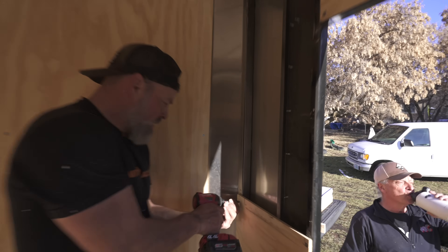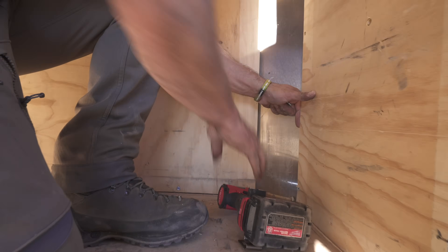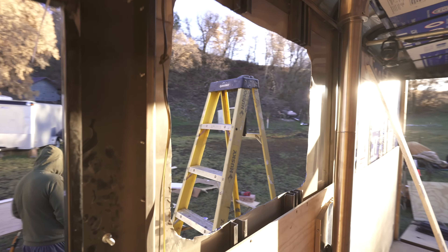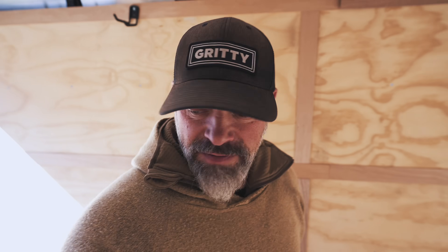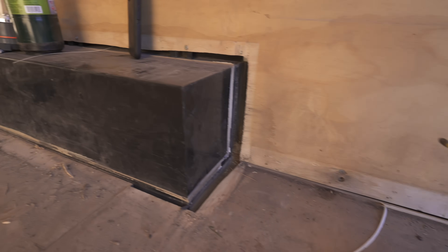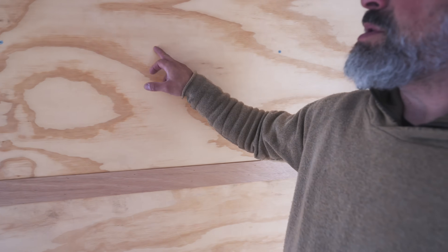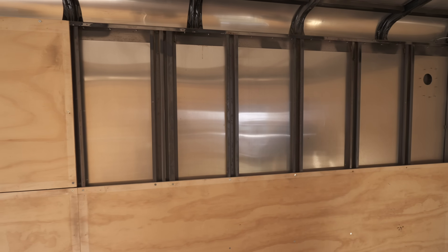Then I'll put the sheeting back on — roof sheeting and all of that — so the whole thing will be insulated. The floor will have basically two inches of ply and reinforcement, sealing up all the cracks there as well. I'll film as I go so if you're watching, you'll see the process unfold step-by-step. The first step is pulling up the molding along the base — Dad's got it up almost all the way — and then we'll pull off all the molding in the center, unscrew these boards, and fill the gaps with foam.